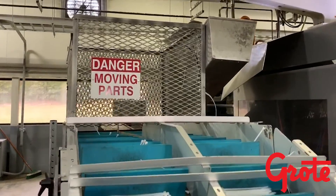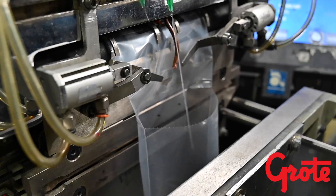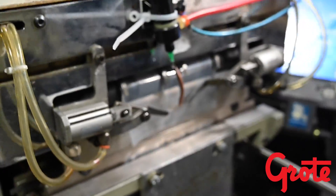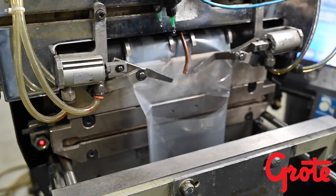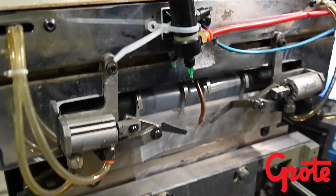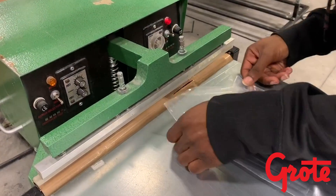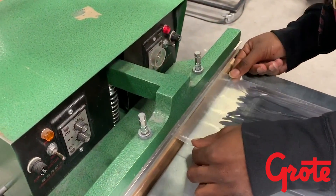When the cable tie is completely dry, it is strong but very brittle. Since some moisture is needed in order for the tie to be flexible, moisture is reintroduced to the tie at the packaging stage, giving them the optimal level of around 2%. For more information, see video 2: Environmental Conditions and Cable Ties.